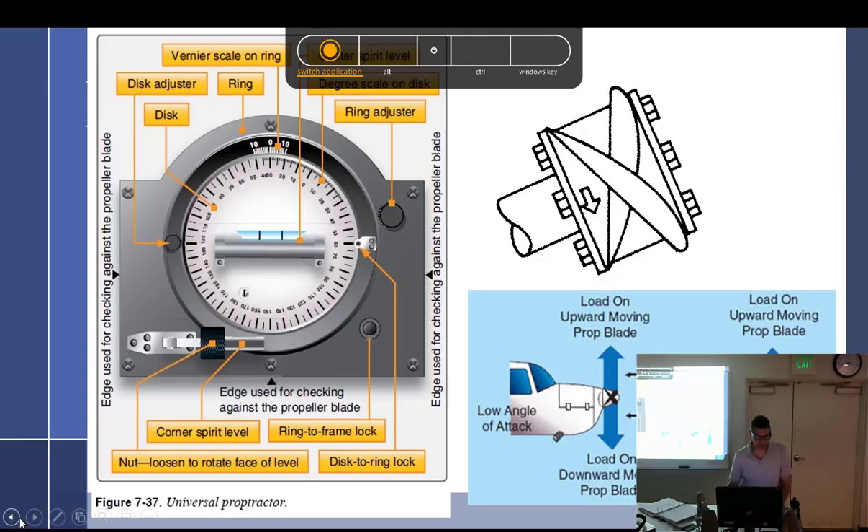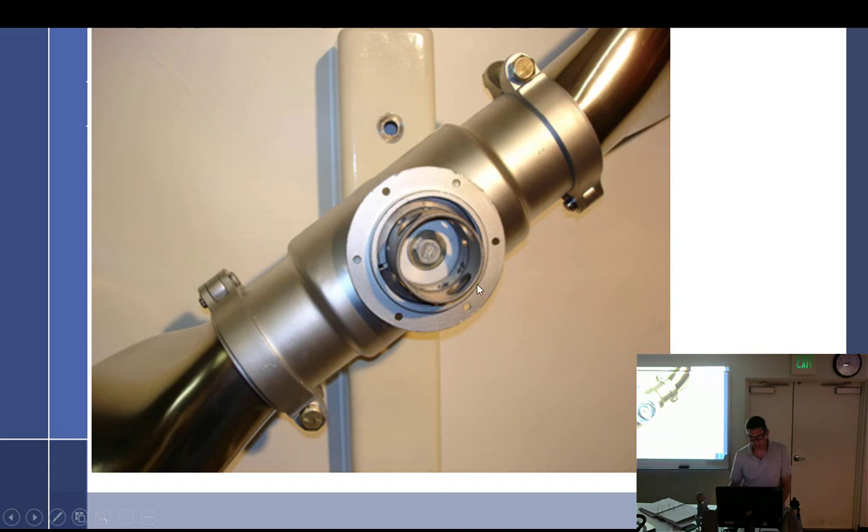There is a safety that goes in here — it is a clevis pin. It goes from the inside out, because centrifugal force will hold it in. There is a washer that goes with it. The order is: clevis pin, then washer, then cotter pin.